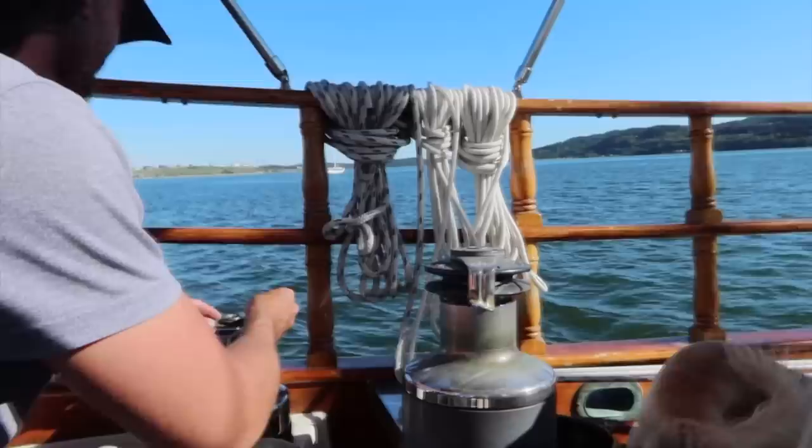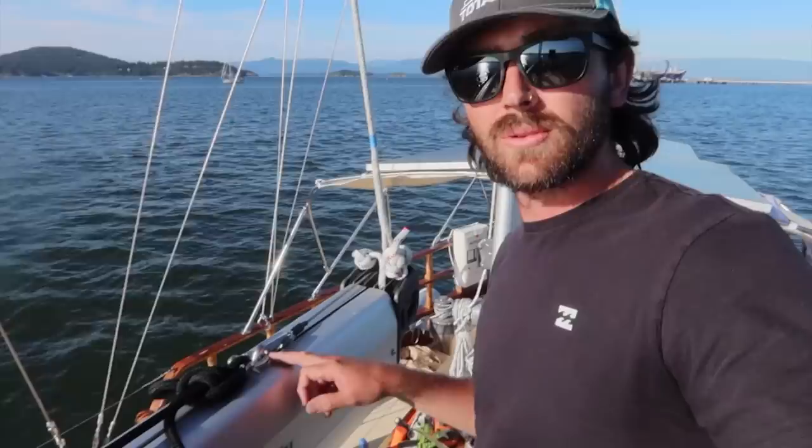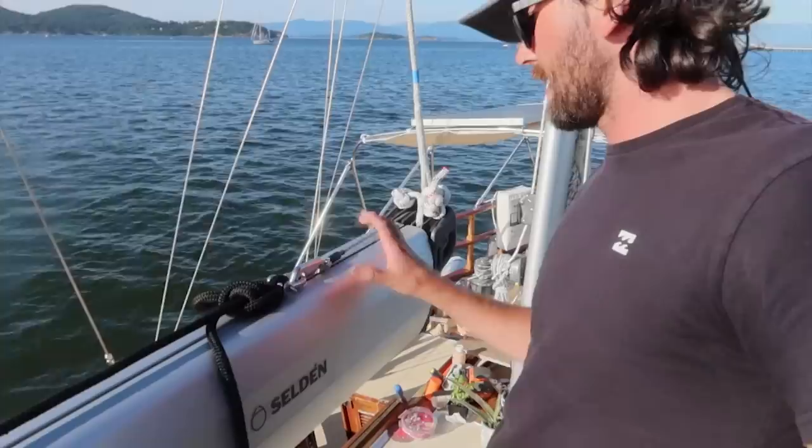So when we put the boom up, we realized that it wasn't going to clear the backstays, so it needed to be shortened. But in the process of shortening it, the outhaul, which is a steel cable, wasn't modified. So at the max outhaul pull out, you see, got about this much. From the eye being here to there, you got just over a foot.